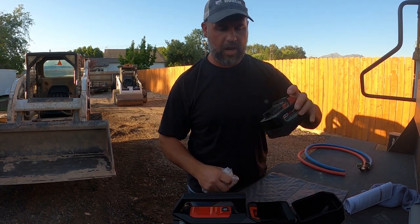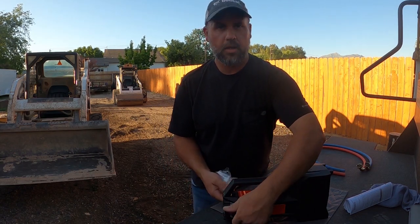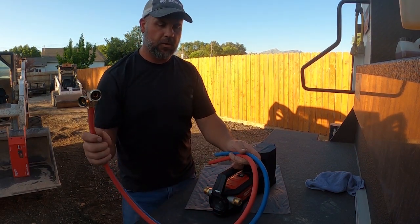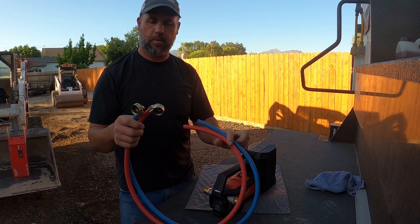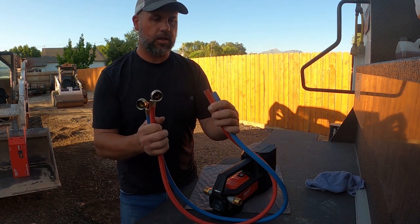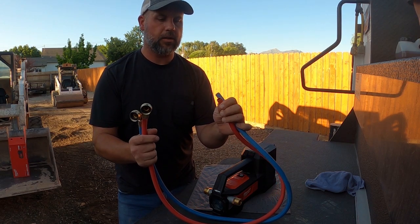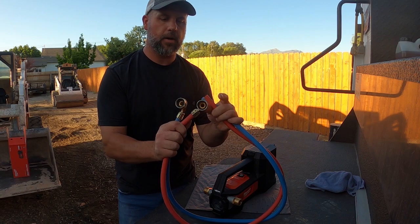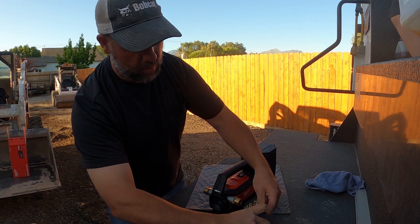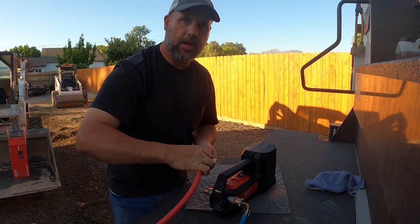Battery goes here. We're gonna run a 9 amp-hour battery on it for testing. Turns on — that's all we need to know. What I've read and seen other people do is they went with washing machine hoses, and I think that's a good idea. Number one, they're small in diameter so I can get into small holes — hydraulic tanks, transmission cases, whatever. It won't pull flat or collapse as easy as a garden hose, and they've already got the three-quarter brass connectors. I cut the straights off and I'm just gonna use the 90s. Blue on the inlet, red on the outlet — red for danger.